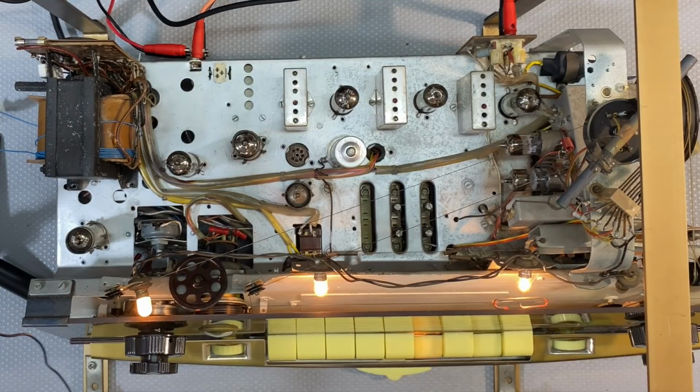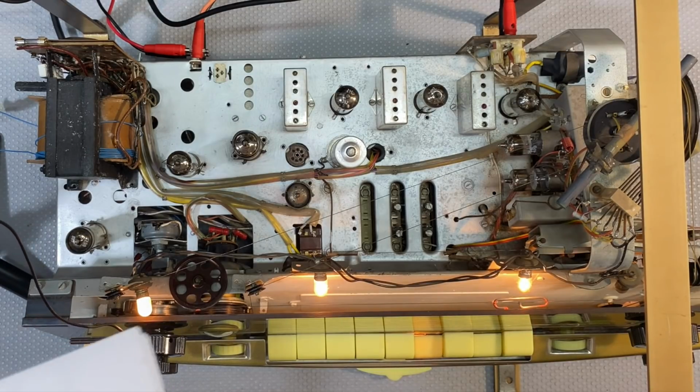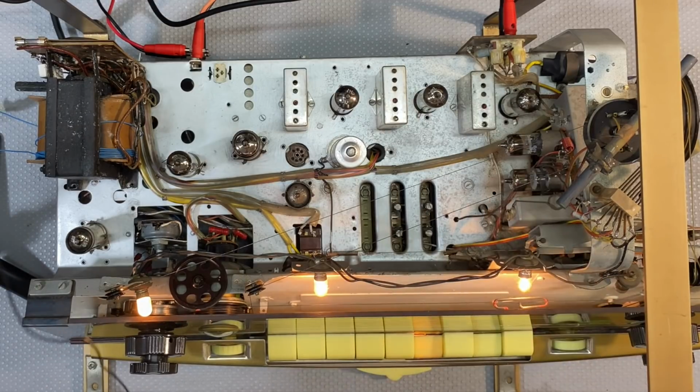Now I've got the signal generator connected, and there's a modulated signal on there, and according to the instructions you press the K key, which is shortwave. Let's see what else it says. Deactivate. The signal's going into the antenna socket. We don't know what level to put it on yet, so it's going through with 9 dB of attenuation. Automatic is off. Now they tell us to set it for 7.1 megahertz.